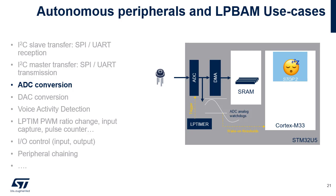In a third LP-BAM scenario, the low-power timer periodically triggers a sample acquisition. A DMA channel automatically transfers these samples to a memory buffer. A wake-up of the Cortex-M33 is requested on the condition that the ADC analog watchdog detects a conversion result exceeding programmed thresholds. Temperature sensor, VBAT, V-Core, internal reference voltage or external channels can be monitored sequentially. Up to 3 channels can be monitored in stop mode thanks to 3 analog watchdogs. As long as the monitored voltages remain within the programmed thresholds, no wake-up is requested, enabling periodic voltage monitoring while the microcontroller is in Stop 0, 1 or 2 modes. Only ADC number 4 supports this capability in Stop 2 mode.